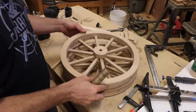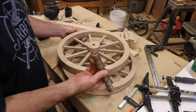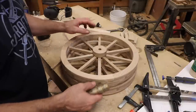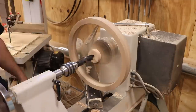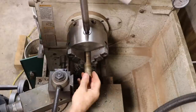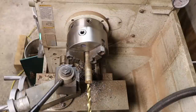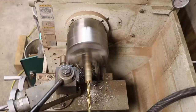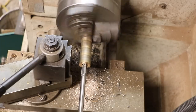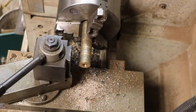I've been trying to decide what to do on the axle and I have this bronze bushing material that would make a nice bronze bushing. I'm going to have exactly one half inch down the center and make a half inch axle that goes into that. That means I need to drill this out to about an inch. Now I need to make a bronze bushing that will fit in that hole. First I bore the internal hole to get it concentric — that bit is one size down from half an inch. Then I come with a half inch reamer which will get it exactly one half inch and perfectly round. Half inch on the money — that's what you get with a reamer.